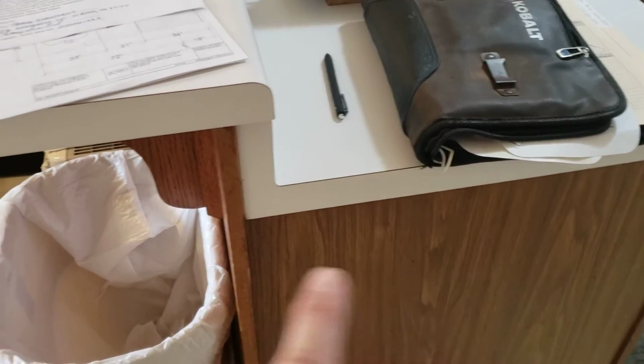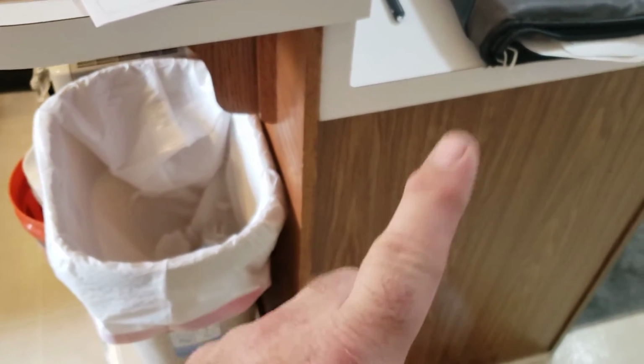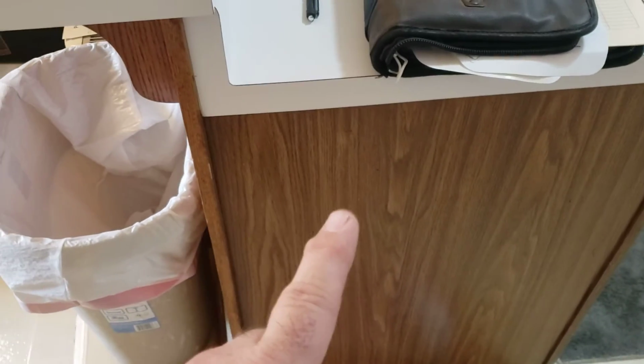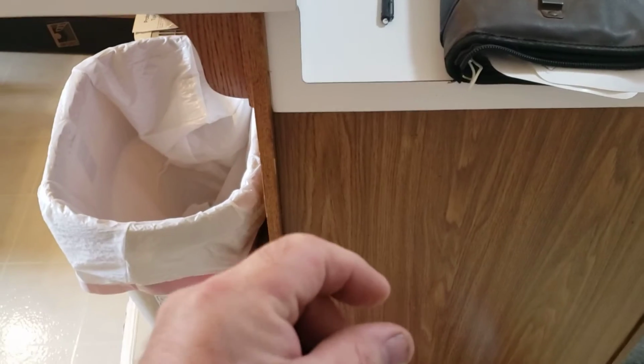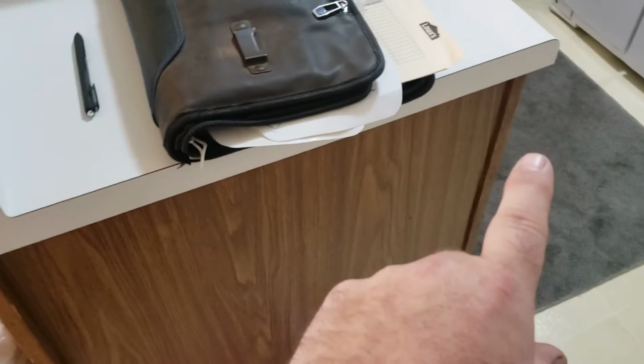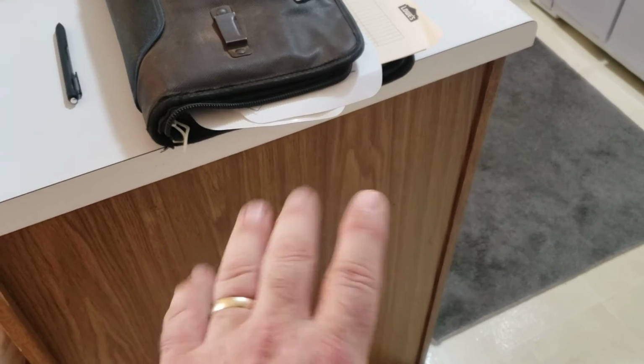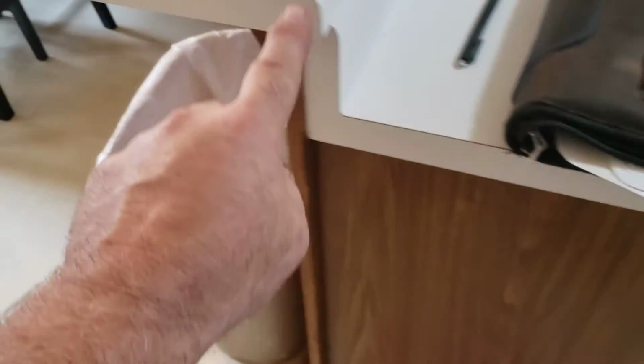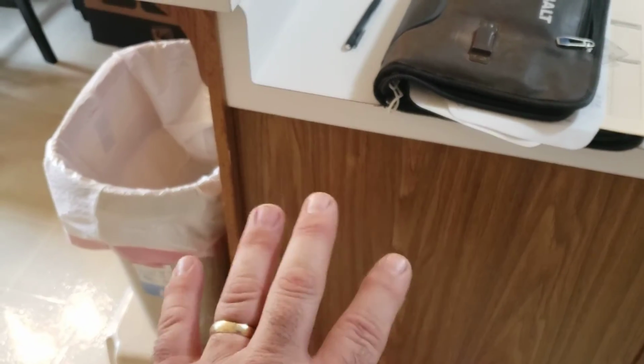Now, in the drawing, I see WPL right here. WPL from Craftmade is 3/8 of an inch thick. WSK is 3/16 of an inch thick. So you need the skin, you don't need the panel for this end piece. And besides that, this needs to be a standard base panel, not flush, but a standard construction, just like this is. And then we need to have this cabinet on this side a standard construction, not flush, so that we can run that skin over, down, into the back of this face frame, up, over, and in the back of that face frame so that we have a continuous panel where it looks like it's all one piece.